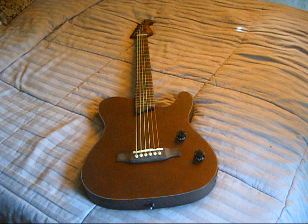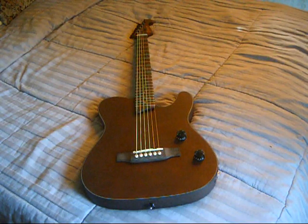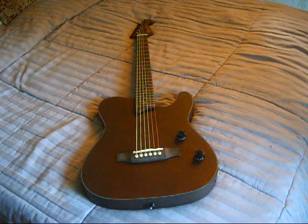I hesitate to say anything because I feel like I'm putting a jinx on the guitar, but the two K10s and the one K6 I had before all had a pretty noticeable hum coming out of the piezo pickup. This, thus far, does not seem to have any hum at all, and I'm wondering if it's due to the battery situation. So they have three iterations: the original K6 has the two watch button batteries, the second version takes a nine-volt battery with a separate door on the back, and the K10 also has a battery door but takes two AA batteries. A button battery puts out 1.5 volts, so two of them together would be three volts — a lot less than nine volts.